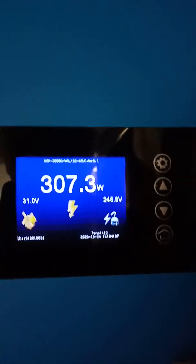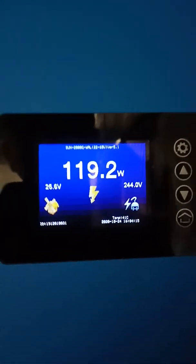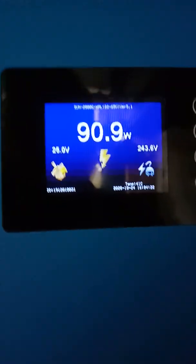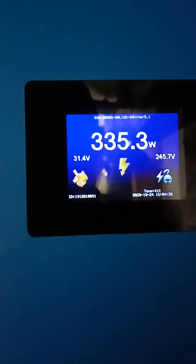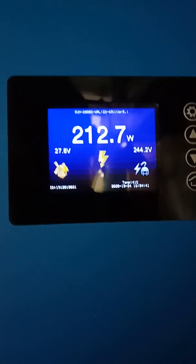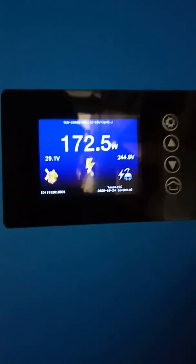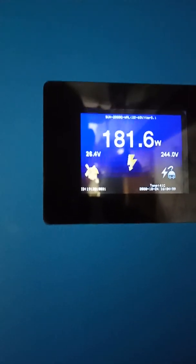It's now working okay. You can convert between solar or wind turbine and change the voltage. When I get some more strong winds tomorrow, I may get some in the 1,000 watt plus bracket. These are just gusts coming through at present — you can see it just spins up so easy, and then the brakes go on, which is the inverter loading the turbine, slowing it down again. If you don't change the load on these things, the turbine makes a lot of noise — it spins really fast and starts to whistle. But by increasing the loading to stop it spinning just as fast, it's fine. It won't make as much noise and won't annoy your neighbours.